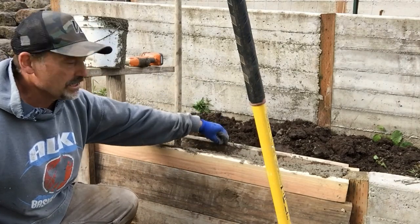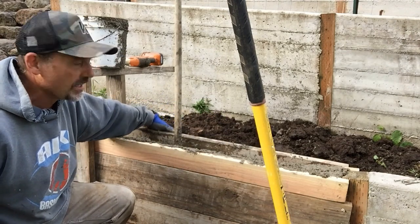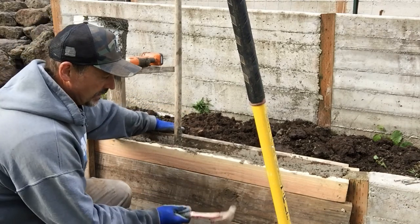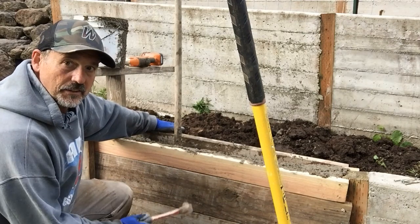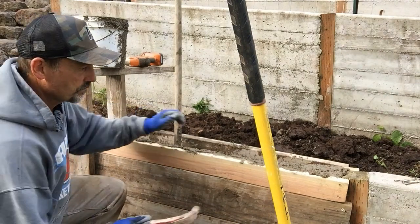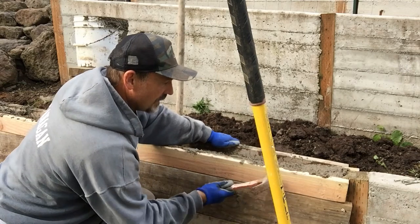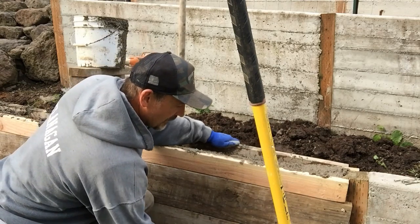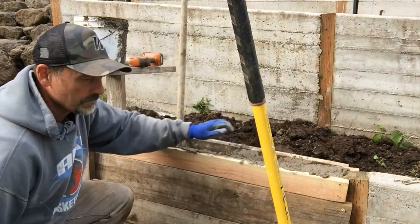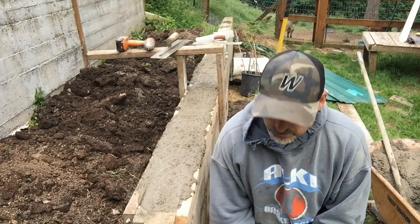Now when I get to the last board, I put a 2x4 on the top besides just the plywood. I will be tamping that because the dirt may not cover that part, but I need to continue to vibrate, tap the entire face of this on the front side and the top board on the back side. Especially the corners. So I'm gonna tamp this back in.